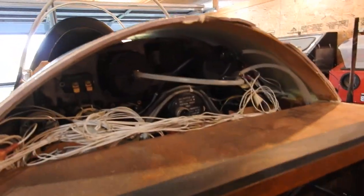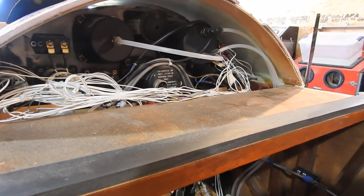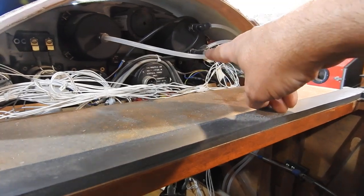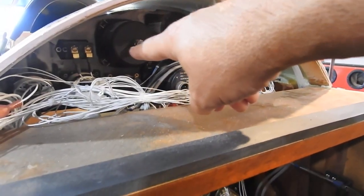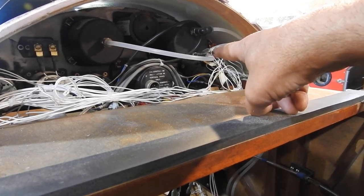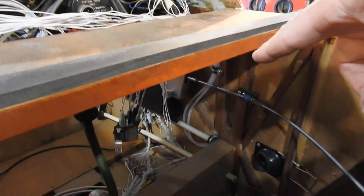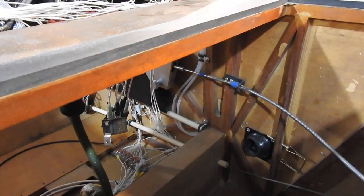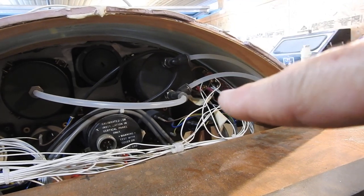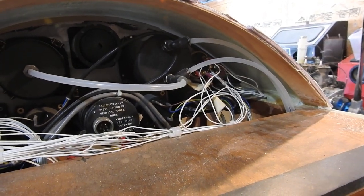I got in the back and kind of tied things up. Went and bought some polyethylene tubing. This is the static line from the altimeter to the airspeed indicator, and then the line out to the wing. So I had to snake those all down through, run them outboard. Got everything wired up to the actual ignition switch. So everything is now wired to run.